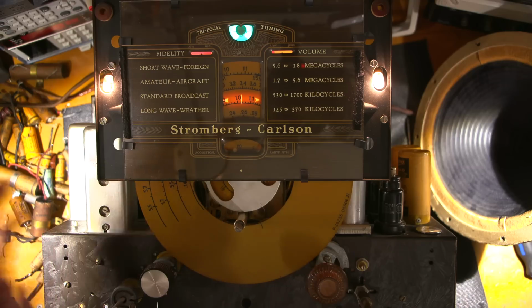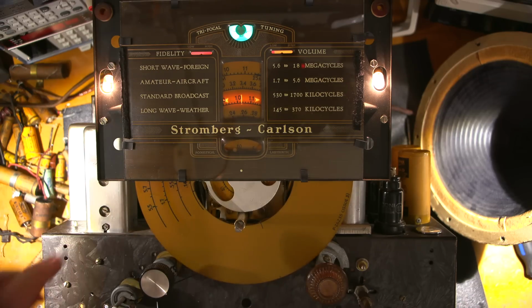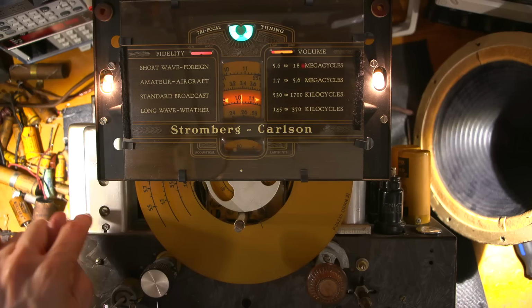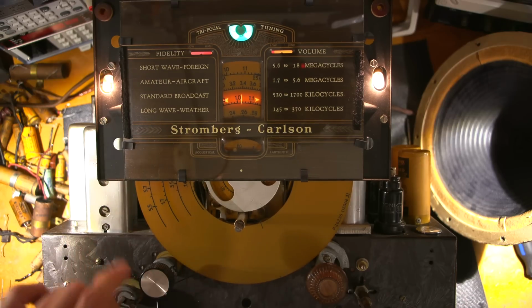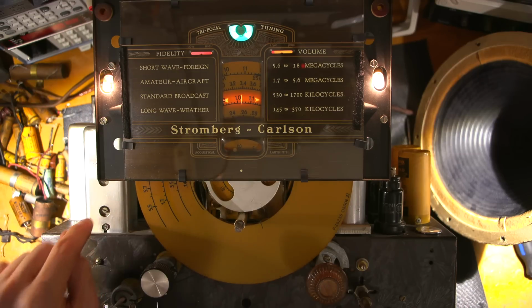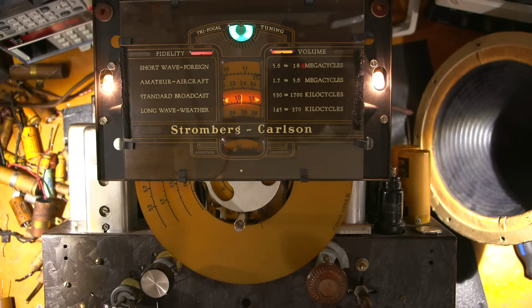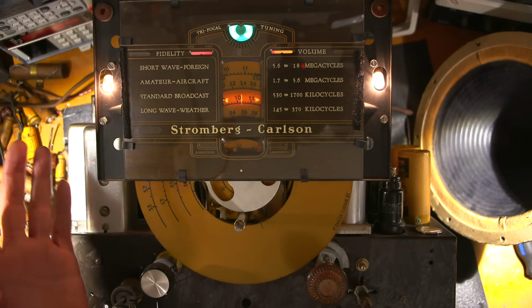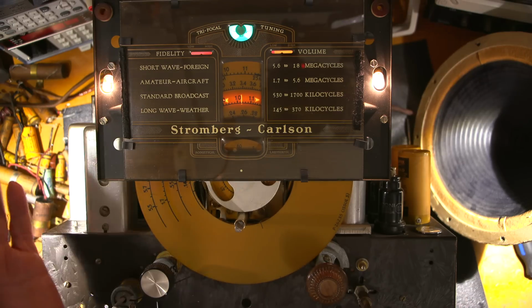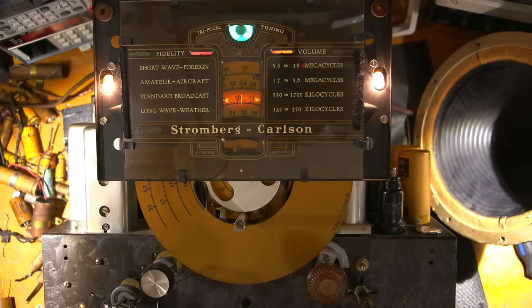If I had one of these caps out, I would show you. It's just a big threaded screw that tightens some plates together inside of a cap here. So normal tuning tools will get absolutely destroyed if you try to twist these, because normally these are very tight. So again, it's all about balance. Use a normal insulated screwdriver where possible, and then save your tuning tools for what they're actually needed for when you're dealing with powdered iron slugs and things like that.